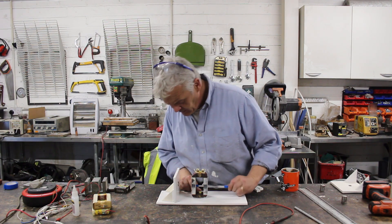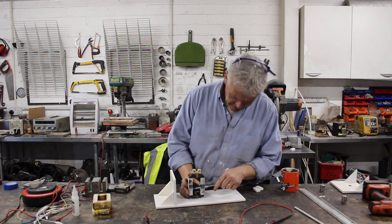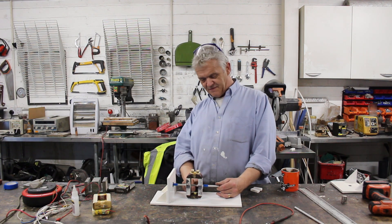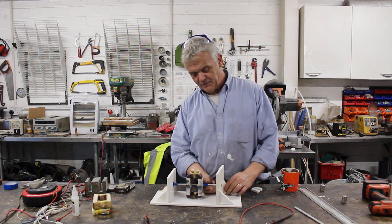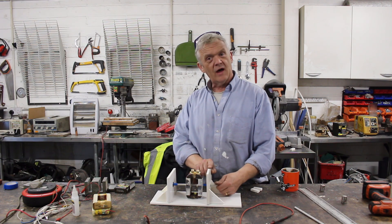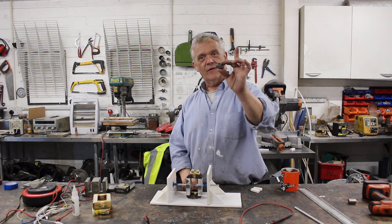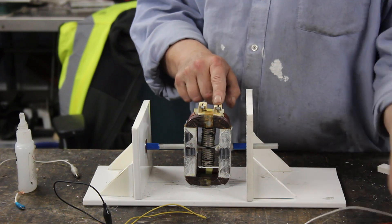When I feed the axle in, the blue tape stops it going past the bearings and holds it in place in the centre, with the flat section now sitting between the two coils. I've got another angle bracket with another bearing that goes up against the blue tape. So if I spin that now it spins between the two coils. All I've got to do is stick some magnets on that flat piece right there — and that's it.